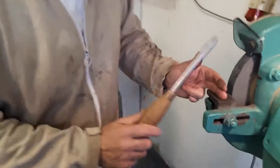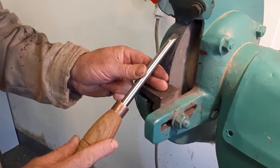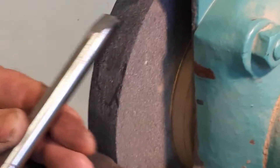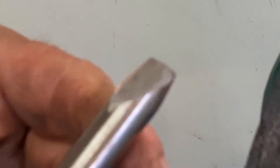Fingers on the rest, thumb on top. Start as you did before, come down, find the angle, and instead of doing as previous where your fingers slid on the rest, you're now pivoting. What this will do is give you a slight radius on the front, and by getting these corners out of the way when you're doing planing cuts, it means you're less likely to catch them.